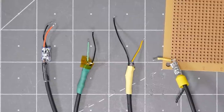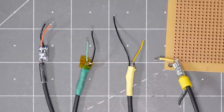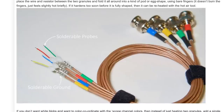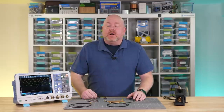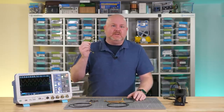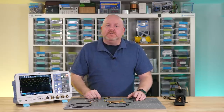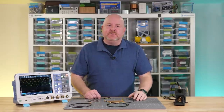In all, I built four variations of the probe, and for the most part they all work pretty similarly. Because of the additional PCB, we have broken the coupling between signal and ground, which means these may not perform as well as the ones that Shabazz built. Unlike traditional passive probes, these resistive probes only have about 1 kilohm of DC loading. But like all probes, they become part of the circuit once you attach them. So next, let's look at how loading affects two different measurements.